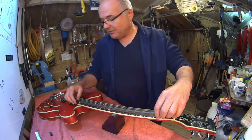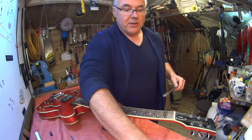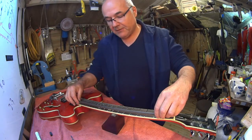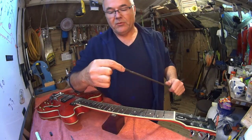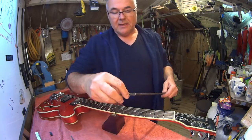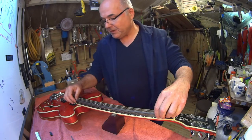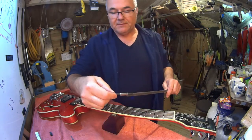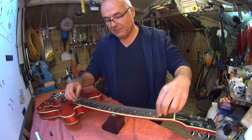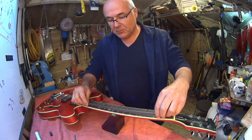So I place this down, and this time I'm going to tighten up to the point where I reach calibration. So little turns, microscopic turns, and once you do this you get a feel for it. You're basically aiming to get all three touching in exactly the same amount, and you'll see when you get there. So right now I haven't got there yet, and when I do, then I'll just carry on. Now that's probably, if anything, a tiny bit over because it's touching the middle before the far end. So I'll just back off a fraction, and now it's too little, so I'm skating over the top of the middle one, which means I've lost the curvature. So it's almost a hair's breadth, right?